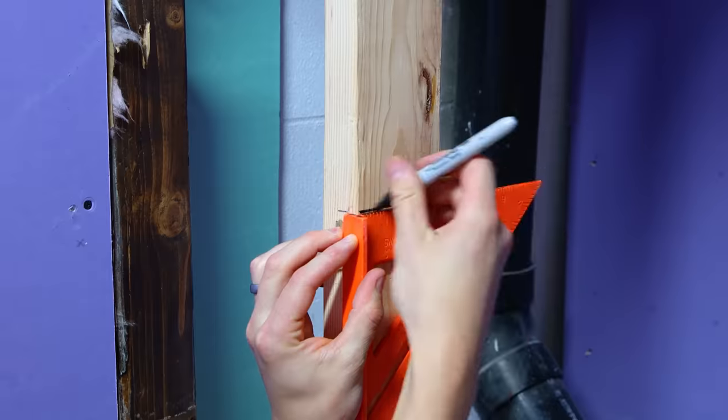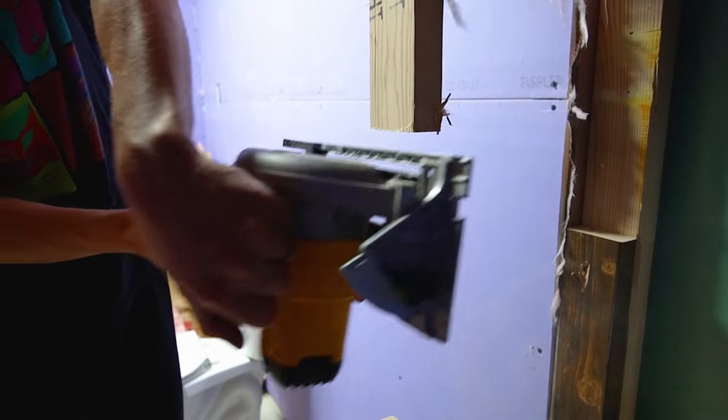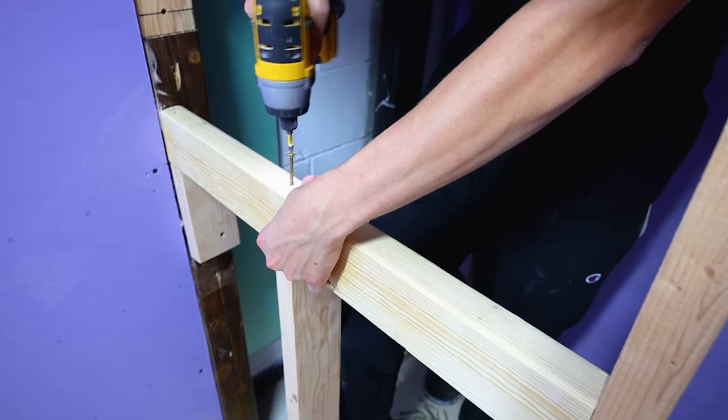None of this is structural, so why not adjust the framing to accommodate a fish tank? I removed the insulation to cut out a portion of the middle frame and leveled out a support for the front, but the tank didn't fit. I marked along the top board and accounted for the thickness of another, then cut off the excess. I leveled out a second board on this for the top, and more screws ensured everything was secure.